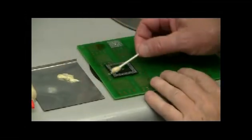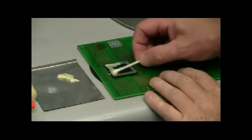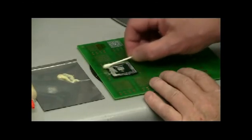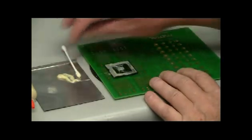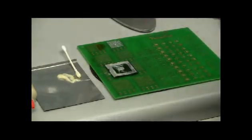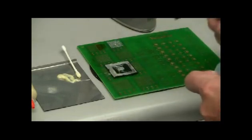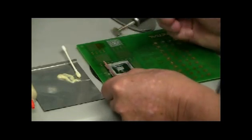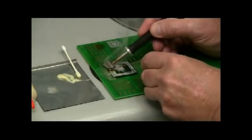Re-balling BGA: gel flux is used to remove the solder on the BGA. The balls are not reusable once the component has been removed from the circuit board. Use gel flux and a blade tip — the blade tip allows you to wipe off a lot of solder balls in one action. Put the blade tip on at an angle and place it back onto the component.